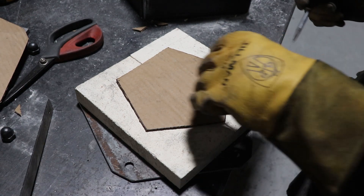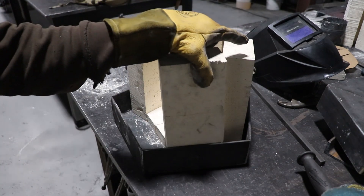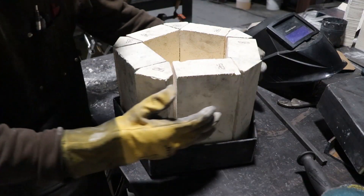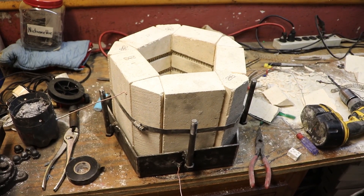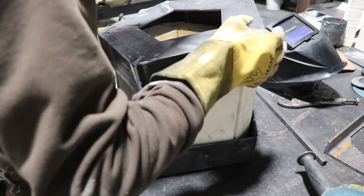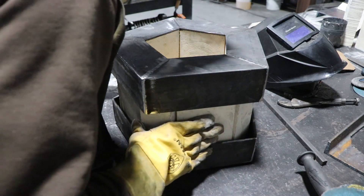To make the floor of the furnace, I used a cardboard template to trace out an outline in two bricks, and this resulted in a perfect fit. I then started assembling all the fire bricks around the frame and adjusted everything for a good fit. I needed to put a hose clamp around all the bricks to squeeze them together, and that worked really nicely. I like this frame design because it allows for easy maintenance and repair. If I were to build this frame again, I would also consider adding more space for ceramic fiber insulation, also known as kaowool.